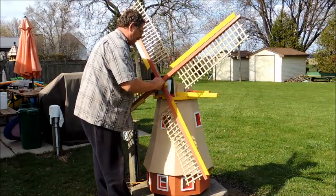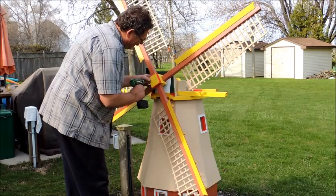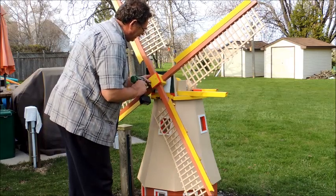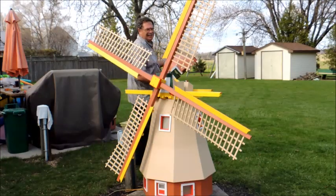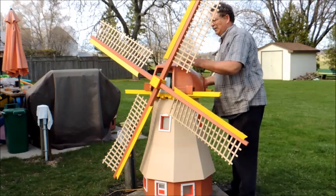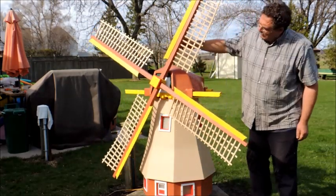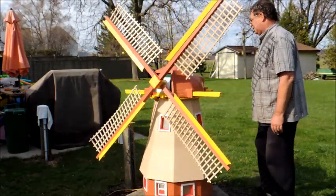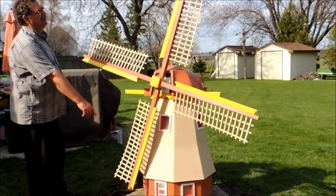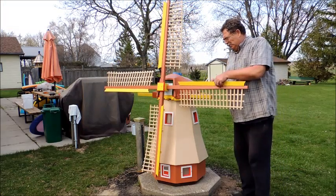Next we'll be installing the cover. Here we've got the cover plate, just tightening up some screws. I'm going to install the hood over the head. The substructure of the hood is wood and it's covered with fiberglass cloth and fiberglass resin. I had to tap it on — it's a nice tight fit. You don't want the wind to be blowing that off on you. Here I'm just checking for balance. The heavy end will always end up at the bottom, so you put the weight at the opposite end. You'll have to do both sails to get the proper balance.